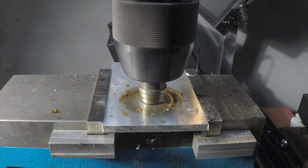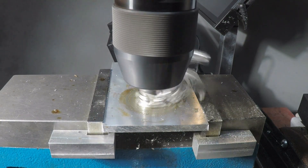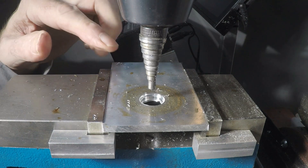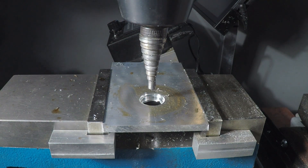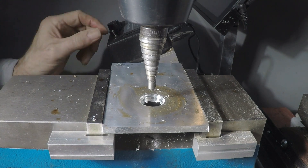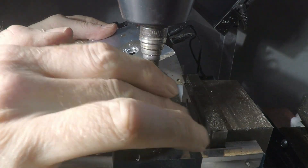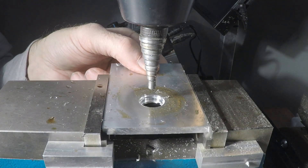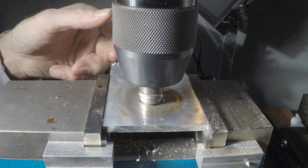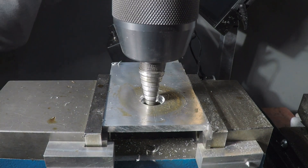Shooting for three-quarter inch here. I realize the drill bit might be hitting the edge of the vise, so I'm going to loosen it up and reposition everything — drive it towards the center of the vise. Now I know I can drill all the way through. The advantage of an Irwin step drill or any step drill is you can just drop the drill right into your hole and realign your concentricity so it's perfectly concentric to the original hole.